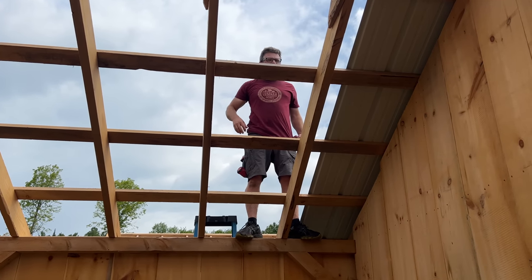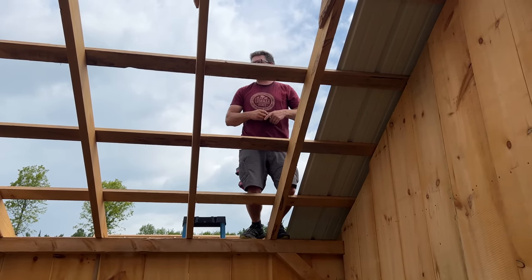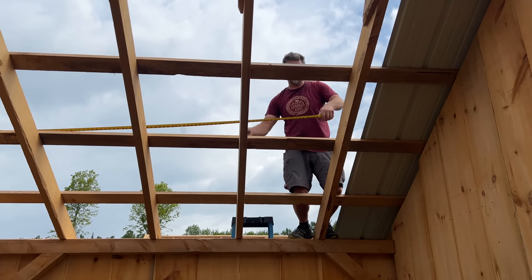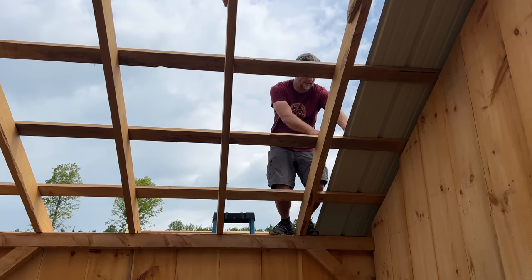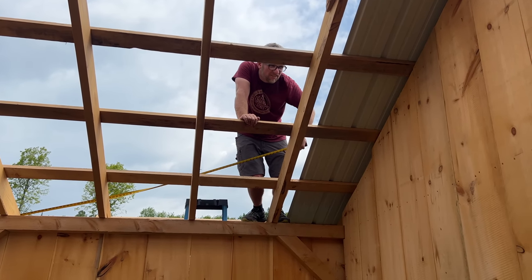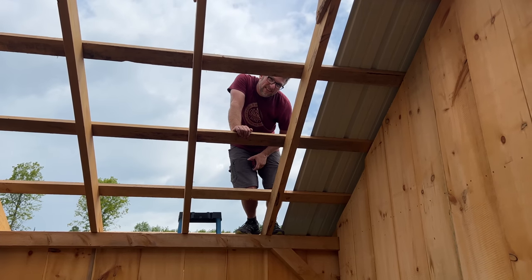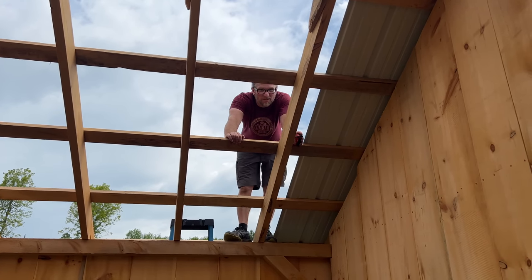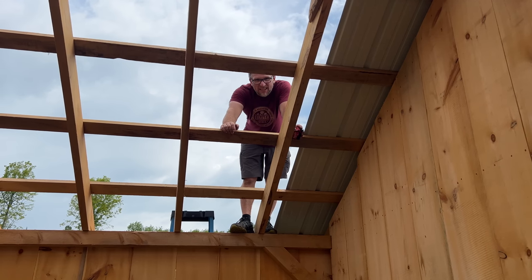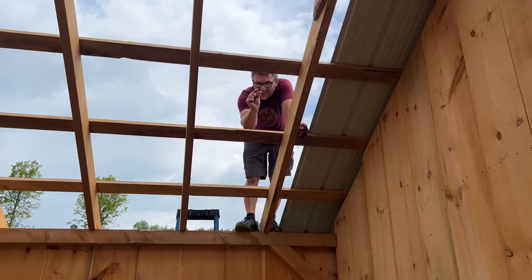So by looking at it, it might fall right where we only need three sheets. Let me get a measurement. So the very outside edge is 9 feet. A sheet covers around 3 feet, so we might only need three more sheets exactly. Or either that, we're gonna need three sheets and a sliver, which would be terrible. But by putting in those clear plastic pieces, it might have bumped it out, so we don't need any cutoff pieces. I mean, it's gonna be that close.